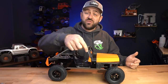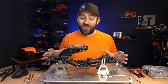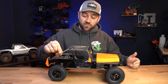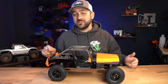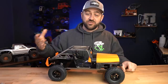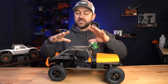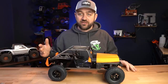One of the most obvious things should be that you now see some cage work here. This is kind of where we left off last time, with me discussing that the cage was about to begin — and it has begun. What we have here is 3/16ths titanium rod that was TIG welded together with some titanium plate work that was done from Send Cut Send, their website where you upload your file, they laser cut it out and ship it out to you super fast. Been really happy with that service. This is just the start of the cage — there are some pieces that still need to be filled in, and we'll get to that later in the video.